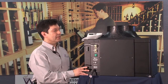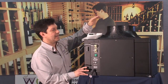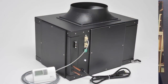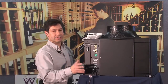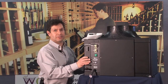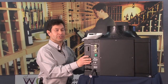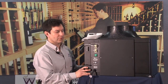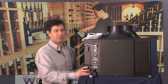You have the flexibility to place duct connections at the top, which is standard from the factory, but you can move them to any one of the side panels depending on where the unit is located. When mounting this cabinet, it needs to be level — plus or minus one-eighth of an inch from side to side and front to back. It must be extremely level for water to keep flowing out of the drain and to avoid any leaking or water buildup issues.